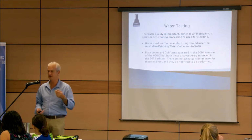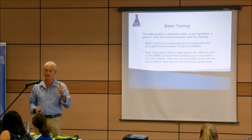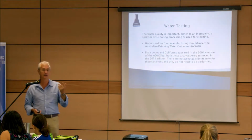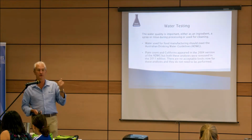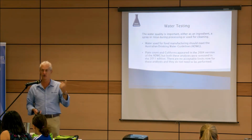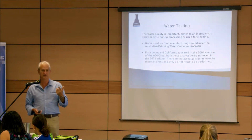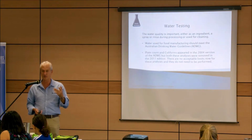Historically, there were 3 tests: a plate count, total coliforms, and fecal coliforms and/or E. coli. That's what used to be required for all premises. In the old guidelines, for chlorinated water, you had to have a plate count less than 100, total coliforms less than 1 per 100 mL, and fecal coliforms or E. coli less than 1 per 100 mL. That's all gone out the window.